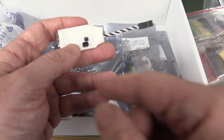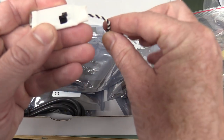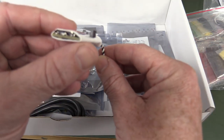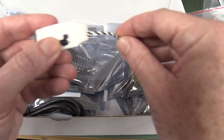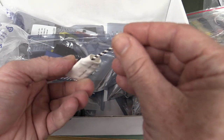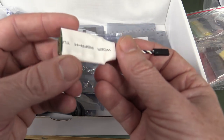So the chip will be there and you'll have a whole bunch of headers surrounding that, so that during debug, and that'll be a special debug version of the board, a special development version of your product PCB, where you just go around and plug in your 64 channels right around your memory chip or your processor or whatever it is you're trying to debug. So anyway, that's rather interesting.